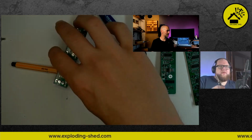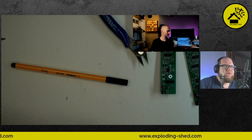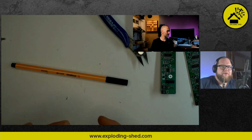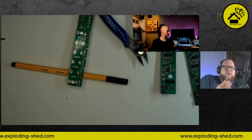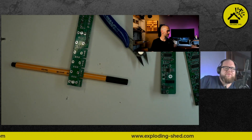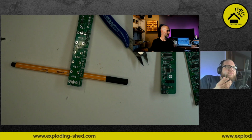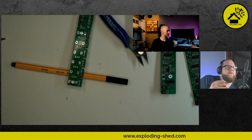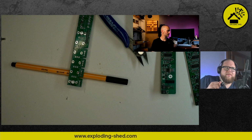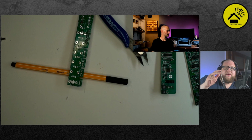The blue one. Whoops. Yeah, so my camera won't focus very well. It's set on manual. But this is a perfect example of a passive tip. It's this kind of soldering tip where you have this flat end, and then somehow you screw the tip onto it. And then the active tips, you'll see this more kind of plug and play system where the sensor and the heating element are right at the very tip of the soldering tip.